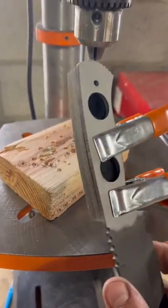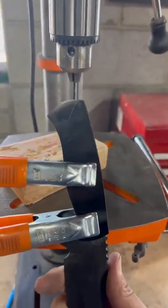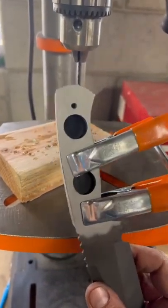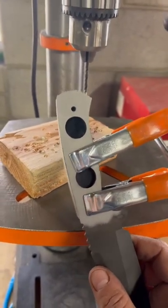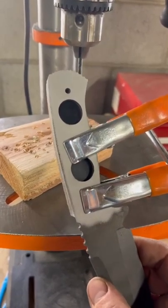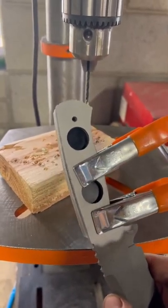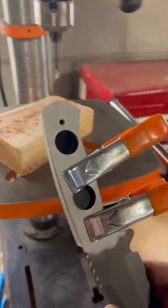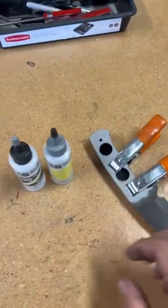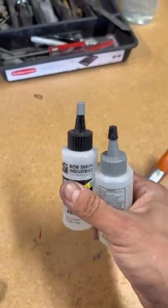Here I have my handle — and once again, you can use waterjet services to cut out your handle scales, which makes it super convenient and they're always spot on, saving a lot of time. After heat treat and tempering, I've sandblasted the blade with 80 grit aluminum oxide, which preps the surface for gluing. Now I'm going to drill three pinholes to accept brass pins.